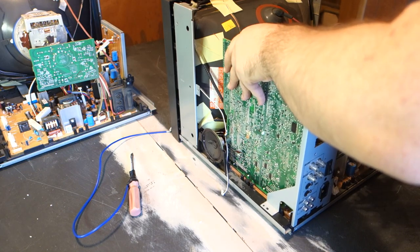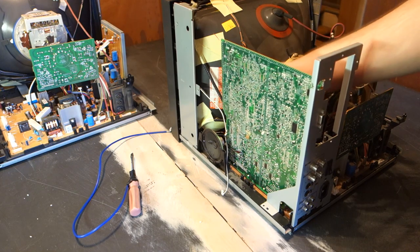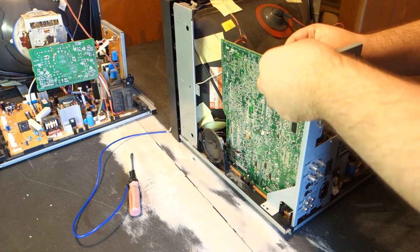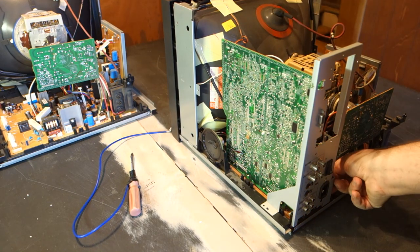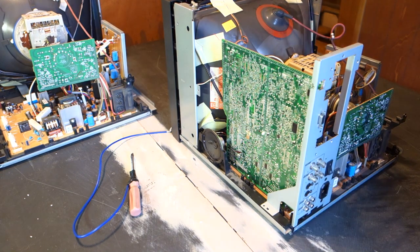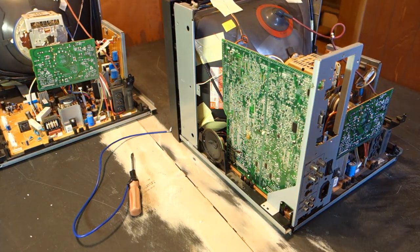From here, you want to make sure to reattach the landing and tally wires to their correct positions. Additionally, you must remember to reattach the AC inlet connector as well as the video lines to the neck board. Now, in theory, this monitor should function as a 1700.